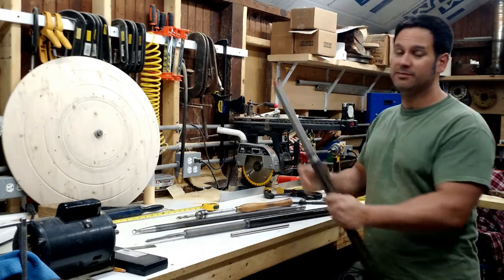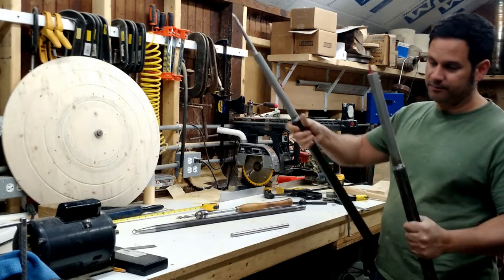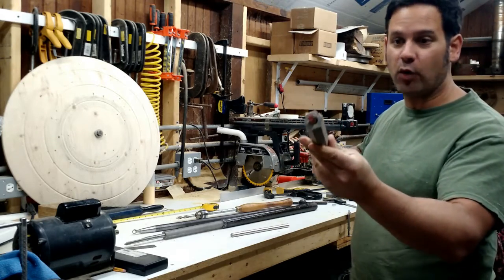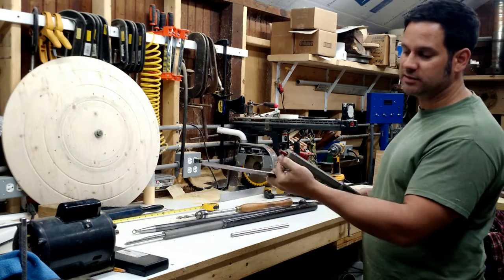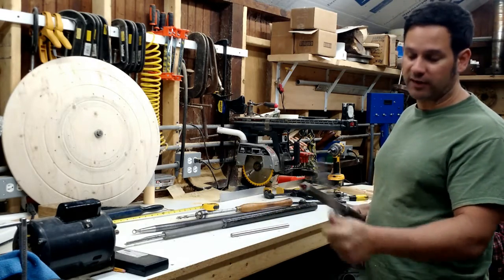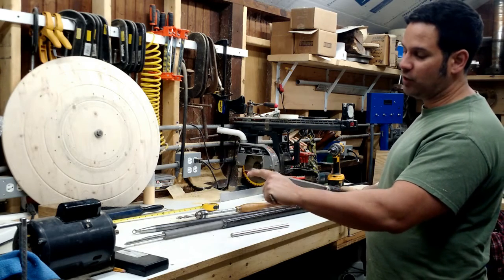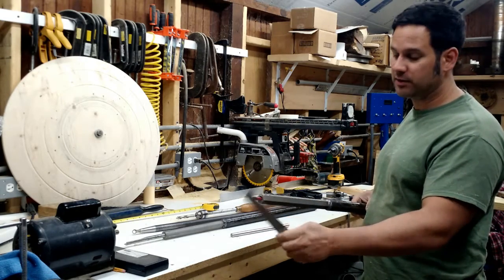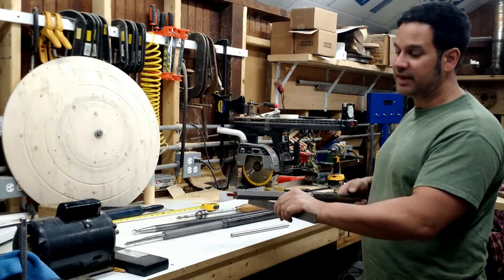The last tool — last but definitely not least — is very similar in construction to my end grain bowl gouge, but it's a little bit different. If you notice, this is not round — it's a hex shape. It's actually quite useful. I can set a tool in the tip and use router bits — that's what this is really for. It's actually a metal lathe tool holder, but you can change any tool you want there. I can even put any gouge in there. Because of the hex shape, you have a nice flat spot that rests on the tool rest, and you can orient your tool tip at an exact angle. If you need the tool presented at 45 degrees, you can clock that in based on the flat of the hex bar, and when you set it on your tool rest, that tool will always be at 45 degrees.